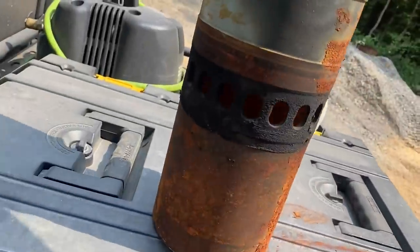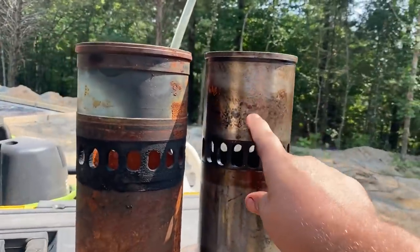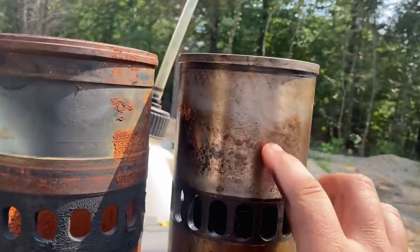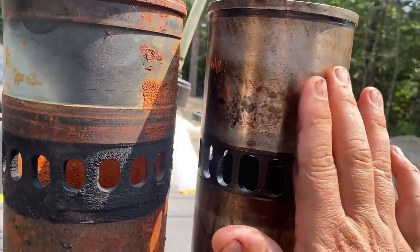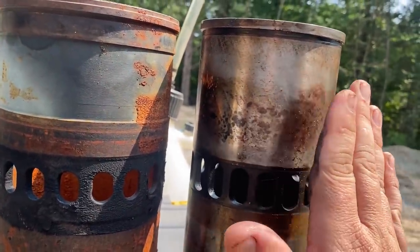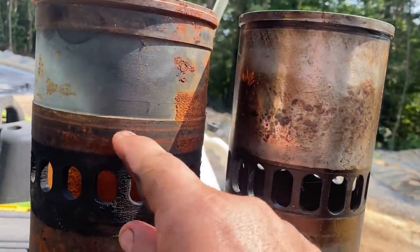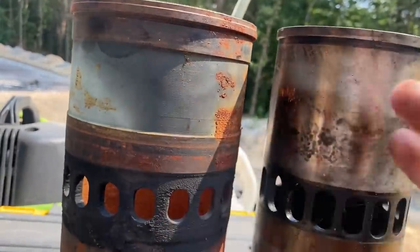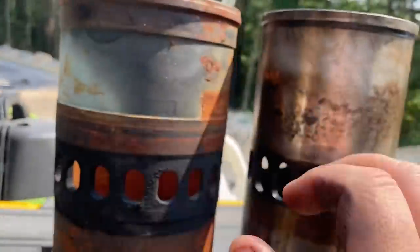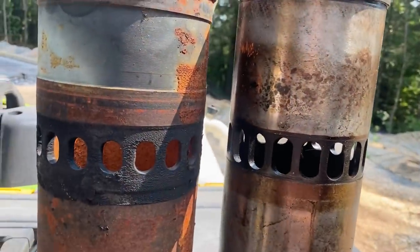Okay. So, other than that, differences. This is what's called a dry liner. It actually goes into the block. The coolant cools the block, and this is touching the block, so the temperature comes from here and bleeds into the block, and then it's cooled from the coolant. This is what's called a wet liner, which means there are O-rings that go here and here, and the coolant is directly touching this liner. So the coolant is immediately removing the heat, versus this, where you're removing it through the block. So it's a little bit more efficient.